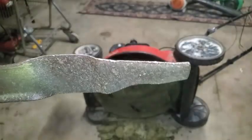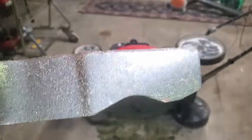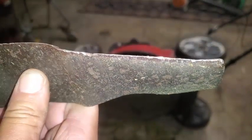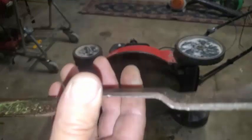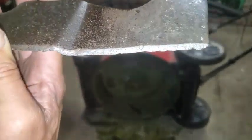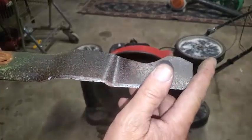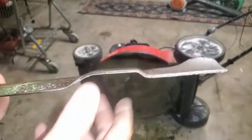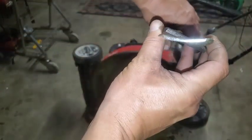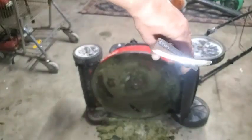You can probably see on this blade — it's in pretty bad shape. The other side doesn't look like anything major, just kind of normal use. Got a little ding on it. So when I sharpen these, you just sharpen one side — see, this side isn't sharpened. Lawnmower blades are sharpened only on one side. What's important is the angle, kind of how you have that angle right there at the tip.